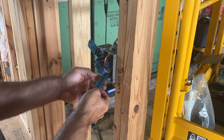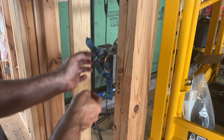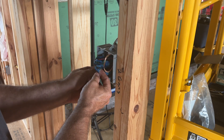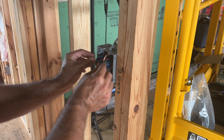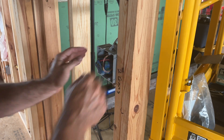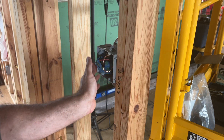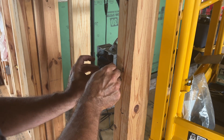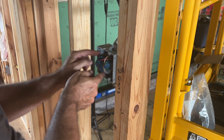Now that we're done, I've put my power, dining, and hall labels back on so I know what conductors go to what. I'm going to tuck that all back in there nice and neat — the inspector can poke around in there and look, and then before the drywallers show up we'll get this pushed back to the back of the box so they can route out their drywall without nicking our wires.